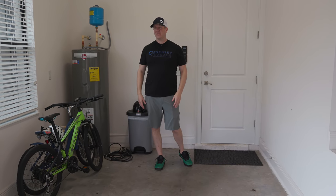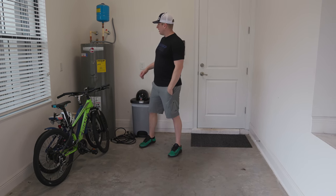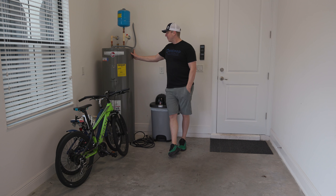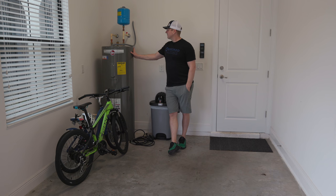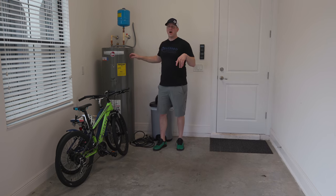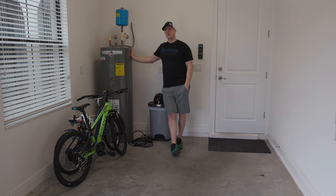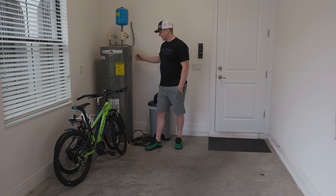This is a little golf cart area — I don't golf. It's a roughly 8 by 9, almost 10 foot area. They put the water heater in the middle of the garage, which I hate. Having it all the way in the garage means by the time the water gets to the master bath it takes a long time and you're wasting a lot of water. I'd like to do a recirculating line. In a perfect world, I'd like to relocate and run the lines up through the attic, do a water filtration and softening system, as well as some version of a gas tankless on-demand water heater — either a Rinnai or Rheem or something like that.